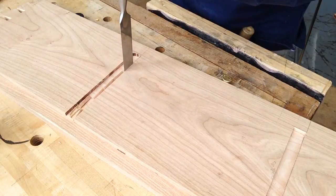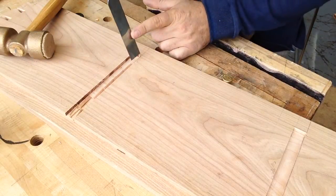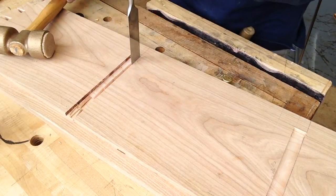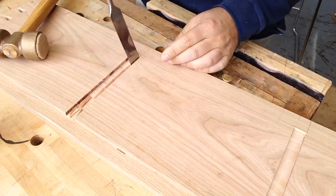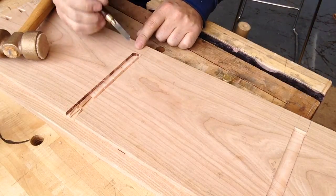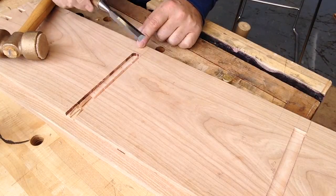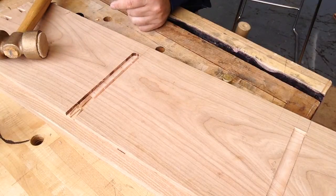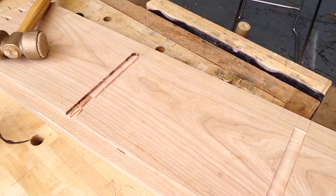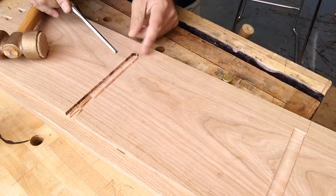Just coming up here, and you want to get close but you've got to be careful at the end. Once you get to the end, you've got to make sure that you cut cross grain first. The way I like to do this is take a smaller chisel - if you use too wide a chisel it's going to pivot here. So take a quarter inch chisel and you just want to create a little step there.